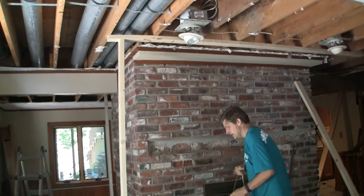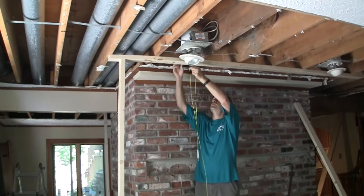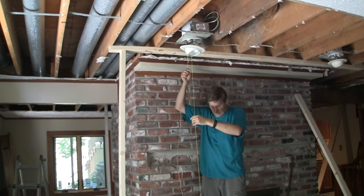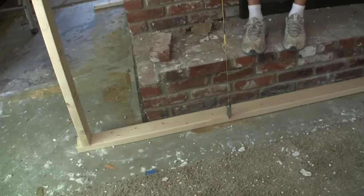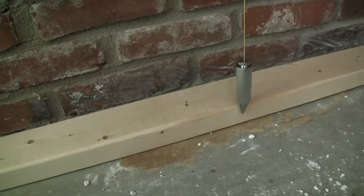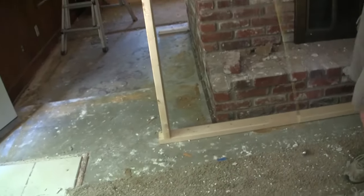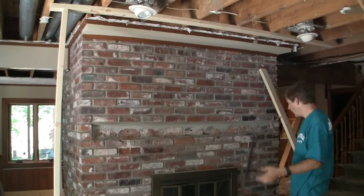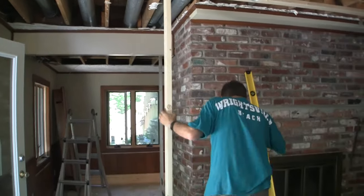What we've done is taken a board — this is functioning as a header. I already screwed it to the rafter. The floor is just above. We take our plumb bob and make sure that this wall comes straight down to the base plate below it so that this wall is straight up and down. We'll also put a level on each of the supporting studs to make sure they're straight up and down. You don't want a crooked wall because a crooked wall won't support like a straight wall will. So we already cut these — cut them a little bit long to make sure it's good and tight.